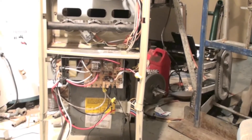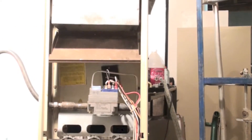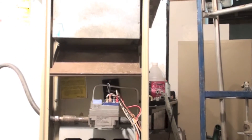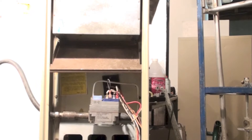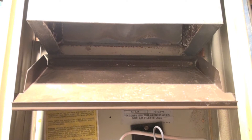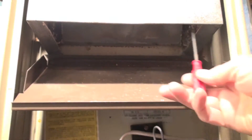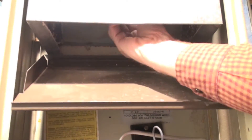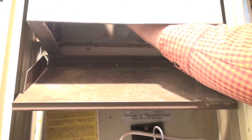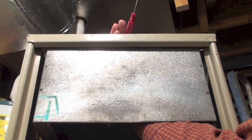This is a look at the different positions of all the parts, and we're going to concentrate on the part above that big sheet metal piece, which is called the draft hood. Here's a closer look at the draft hood or draft diverter — it's a big slot, and it goes straight up and out the top. That's the vent right there.